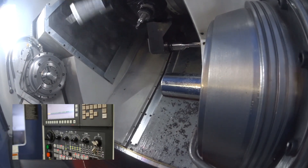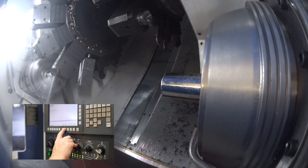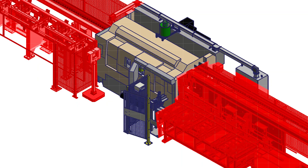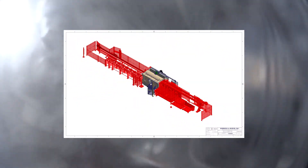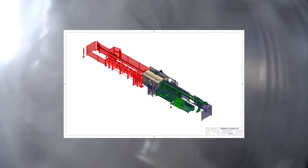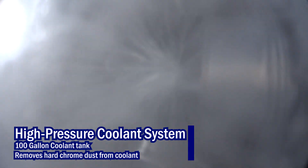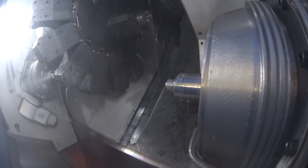It's fairly easy to operate. It's got dual controls for just about every normal function — two cycle starts. Normally the machine is machining both sides of the part, but you can stop that on one side and just focus on the other side. It has independent feed rate overrides, independent cycle starts, independent coolant functions, independent turret index buttons, and independent chuck buttons.